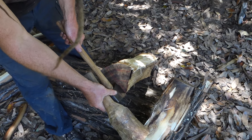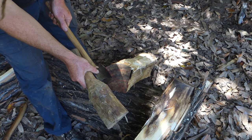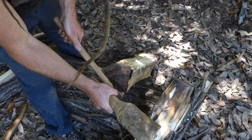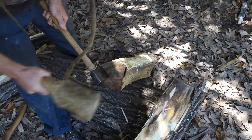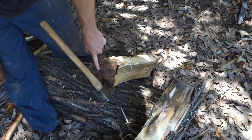Okay, again, through the center, and this line should get us right next to the knot or right through it somewhere in there. It's hard to tell exactly where we're going, but that's the idea. Again, we're going to scooch along here, one little tap at a time. We get all the way across once. You see how I'm splitting this in half?